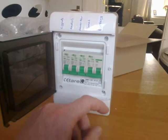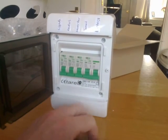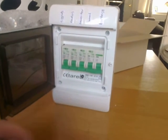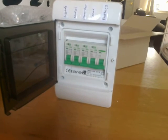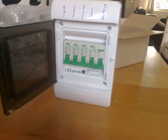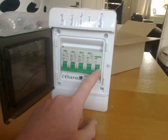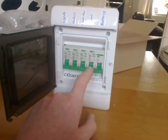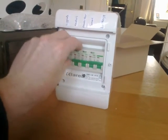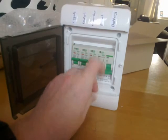The problem is I kind of contradict myself with the solar panel going in - if the battery is disconnected, I'll still have power coming in from the solar panel, which is pointless. I want to look after the new controller - it was nearly 30 quid, whereas the old one was £6.50 so I didn't really care if it broke. With the double breaker, I can have the battery and solar panel on the same breaker, so if either trips they'll trip together.